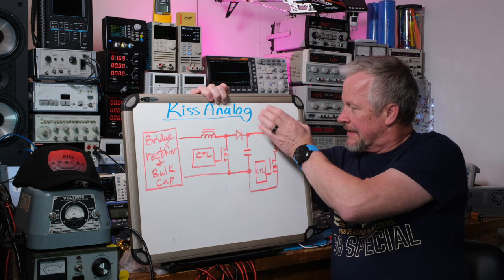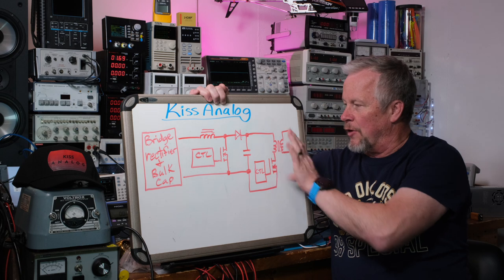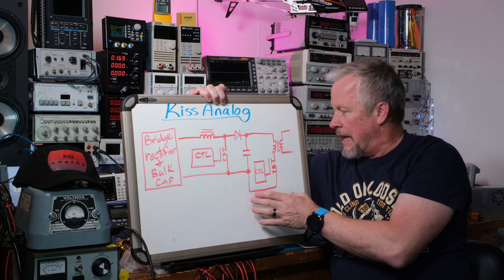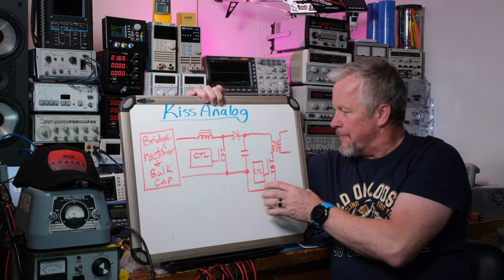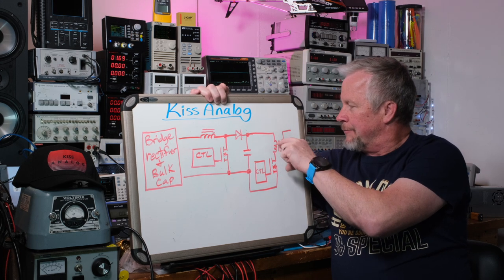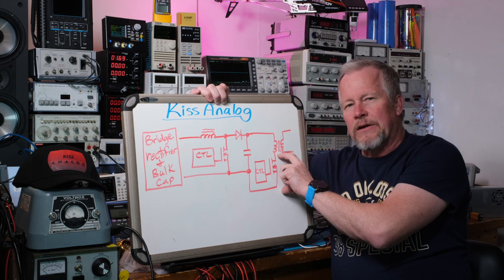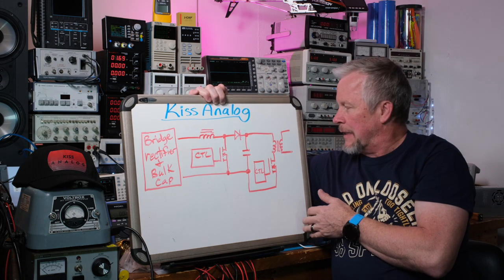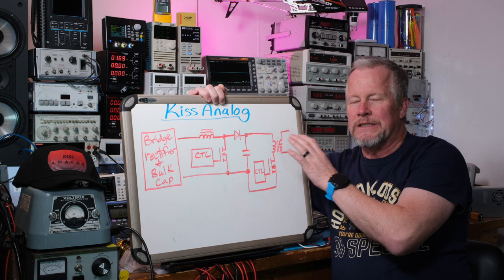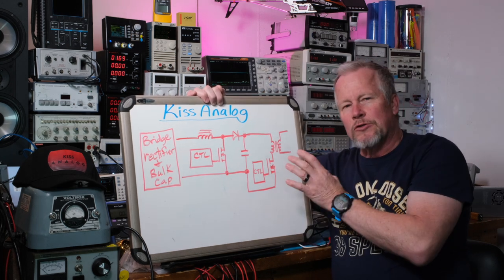The second stage is isolation, where we isolate the output stages. We'll have a plus or minus voltage output, transformer-isolated from everything else. For the switching power supply, we were talking about using an active clamp forward converter. They also have a two-switch forward option — it takes a transistor, puts one on top with a coil in between. Instead of needing one 600–700 volt MOSFET, you have two MOSFETs each carrying part of the voltage, with diodes to steer current and reset the transformer. That chip takes both transistors and the control chip into a single device.